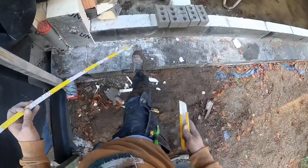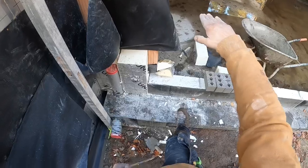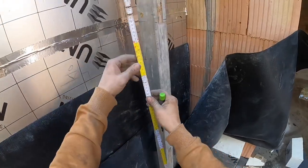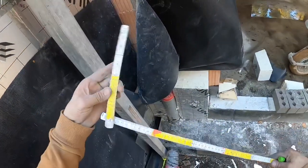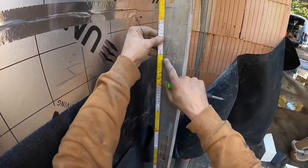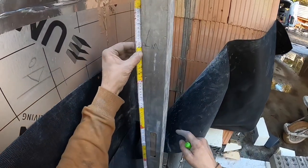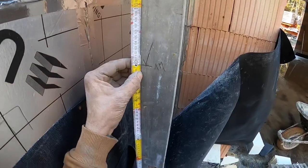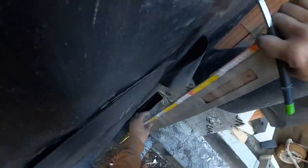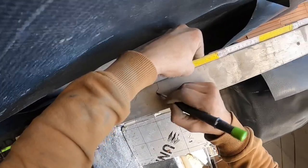You can see them here. We know the course starts at zero from our brickwork — the first course of brickwork is at the same level as the inside floor. So we know this is one meter up from the floor. I put my gauge stick on the one meter mark — here is 80, 90, one meter, 100 — I put it exactly here. Now I know where my first course is, at zero, it's right here, and I can start gauging right away.